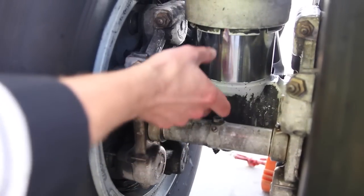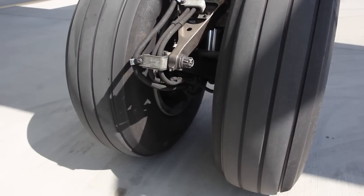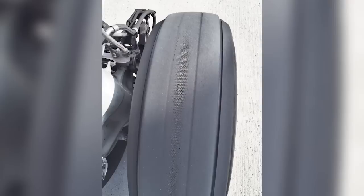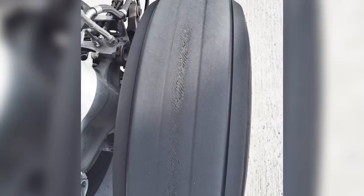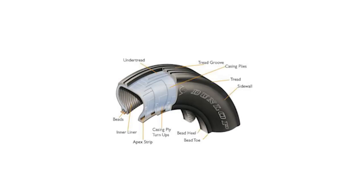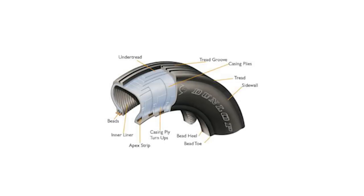You can also see the oleo, which should be clean and show around 4 to 11 cm. Regarding tyre wear, the aircraft maintenance manual has criteria that must be met before a tyre is replaced or signed off as usable. Generally, if you can see the tyre fabric through a crack or cut, the tyre will often have to be replaced. If visible fabric is on the main tyre surface, it may be signed off for a certain number of landings depending on how many layers have worn through. On the Q400, the tyre is often replaced when there is no more tread visible. You must get a certified technician to assess the wear — only they can sign off a tyre.